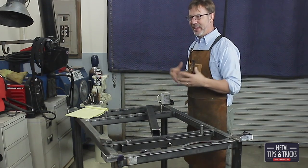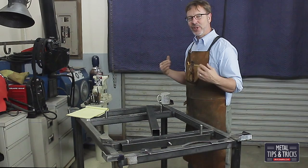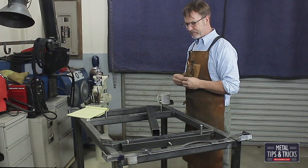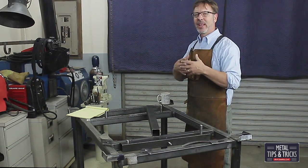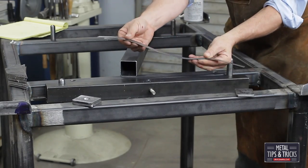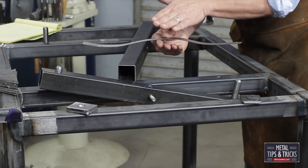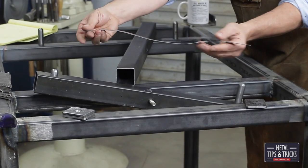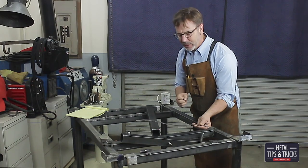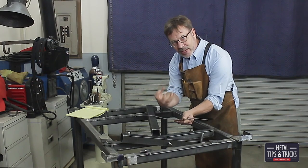To calculate the whiffle tree is very easy — it's not rocket science on something like this. Where to put the four points is determined by using Bessel points. I did a whole video on Bessel points and Airy points, which are very similar in concept — the difference is in how gravitational forces affect something over time. If we take a beam and we need to support it to keep it consistently flat over time, we know if there's too much force in the center the beam is going to sag on both ends. If we put too much force on the outside, the center is going to sink in. Using Bessel points, we can calculate two points inside where the gravitational forces will act equally.